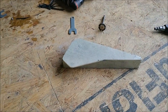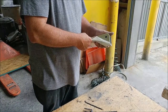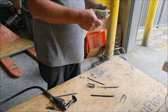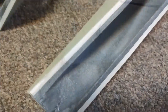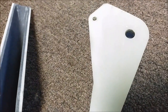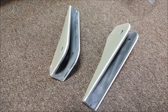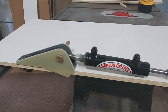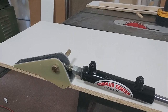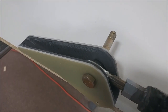Here's Jeff working on the brackets that hold the retraction cylinders for the main gear. He had bonded them together the other day, then put some carbon fiber in the middle to reinforce them. You'll see him removing the peel ply from the outside — there you can see the carbon fiber on the inside, all trimmed neat and nice. Those mount on the lower end of the main spar cap, and the retraction cylinder bolts up to that — that's what's going to be pulling the gear up and down. Everything's getting close to done with the bracketry for the landing gear retraction mechanism for both the main gear and the nose gear.